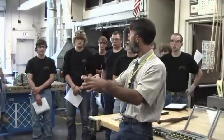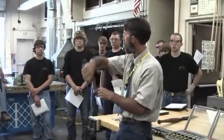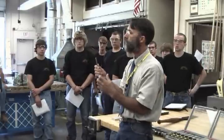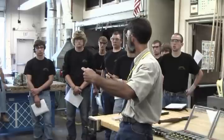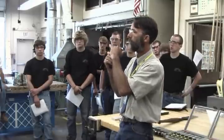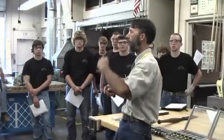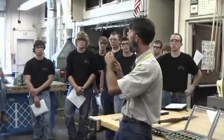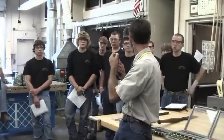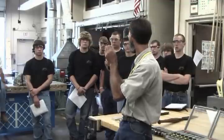Now, great thing to do, have a little cup of water next to you, dip it. Every time you take it off and look at it, dip it. I also make a point of a very light touch on that grindstone. We're not being aggressive here. We don't need to take off a lot of metal. Just a very light touch. And what's happening with that grindstone, as it spins, there's air around it, it's flowing with the wheel. Right? And that air is helping to cool this off. Not much, but by doing that very light touch, that air is helping you keep from getting this hot.